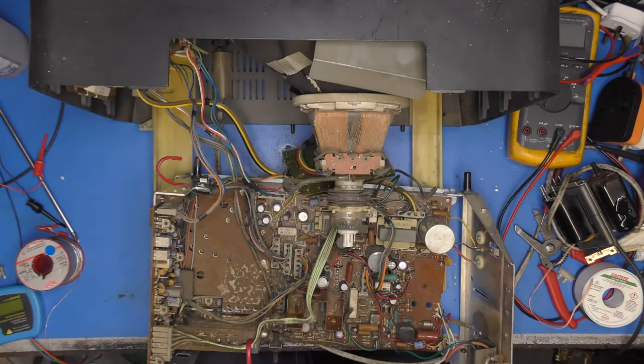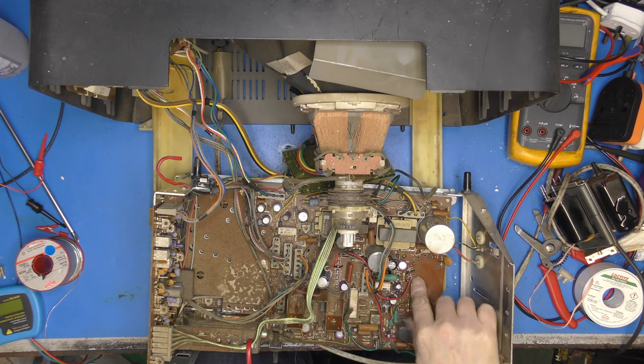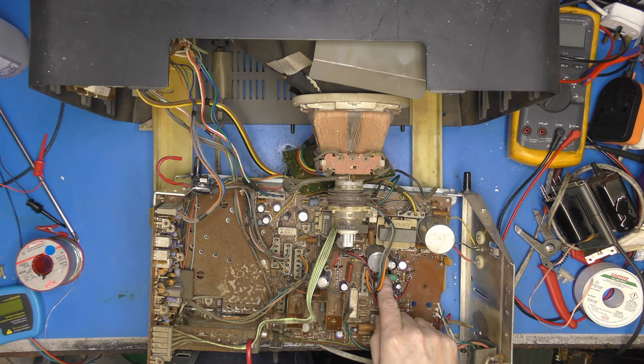Right, something's just triggered another memory. And that's these little diodes. I'll show you the top camera. It's got more resolution. There it is. That's that diode that goes between pins 7 and 8 on our transformer. And that's the resistor that's getting hot that feeds it.